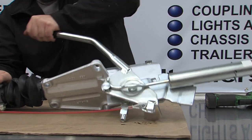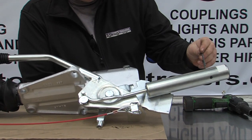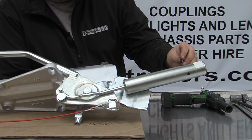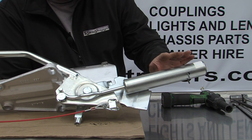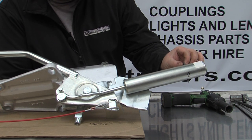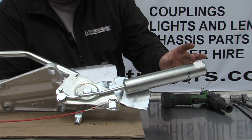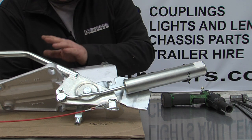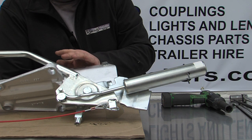At the moment this energy store is restricted. It has a pin in the back which stops it going through full travel. If you were to lift the handbrake without these pins in, the handbrake would be lethal. If ever you're working on a handbrake on a Bradley coupling, it is always a good idea to put these pins in — even nails or screws or something similar — because a handbrake that isn't restricted can seriously harm you or damage things around you.